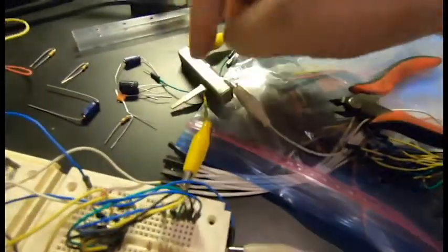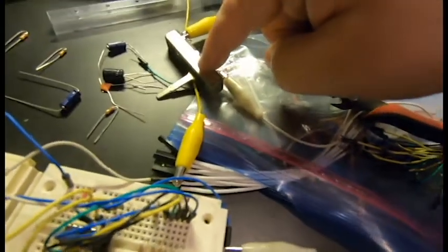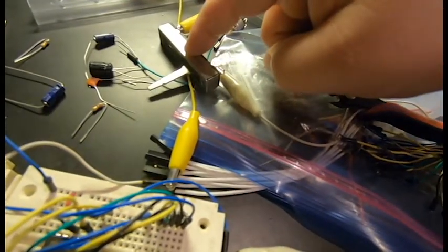But that did mean that I wanted it to be able to go faster. 200 BPM is an upper aim. I definitely want it to be able to at least get to that. So I have changed around this capacitor. It's now 1 microfarad instead of 10. I've changed the resistance, the R1, and I switched to this different potentiometer, a slider, which is what I actually wanted to originally use. But this just goes up to 25 kiloohms instead of 250. But it now works okay.